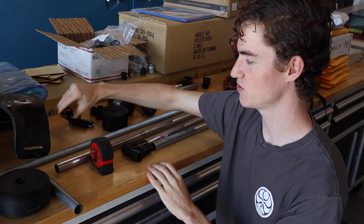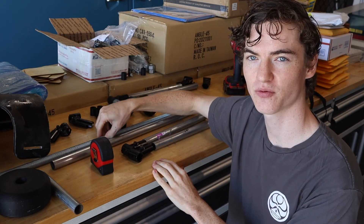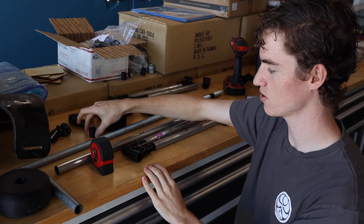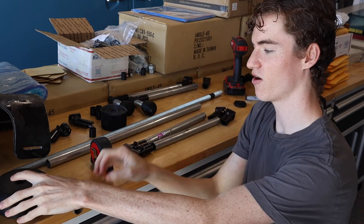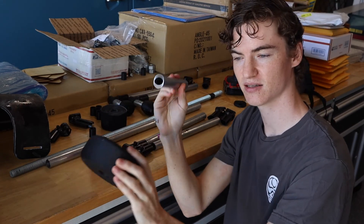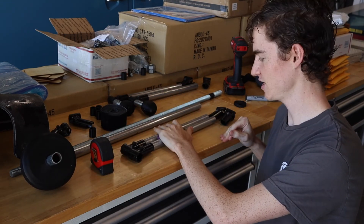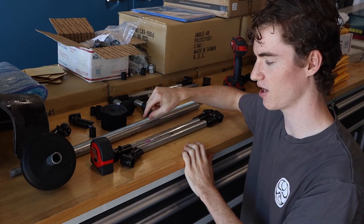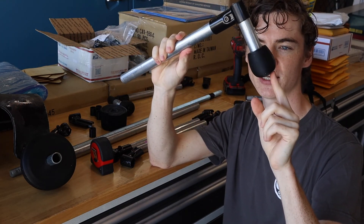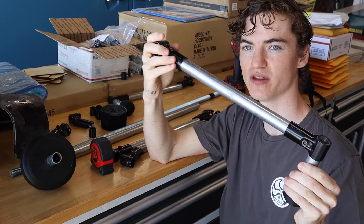From the harness it attaches to maker pipe, which is EMT conduit, using 45-degree connectors from maker pipe. Inside the middle shaft we'll have our axle, and we use 3D-printed threaded spacers to make a snug fit for the axle. We'll have a tip stopper wheel that uses this pipe as an axle — I 3D-printed this wheel for a perfect fit. We've also got the squat stoppers, partially assembled with 3D-printed nubs at the ends and a 90-degree connection, along with more maker pipe connections going to the main frame.